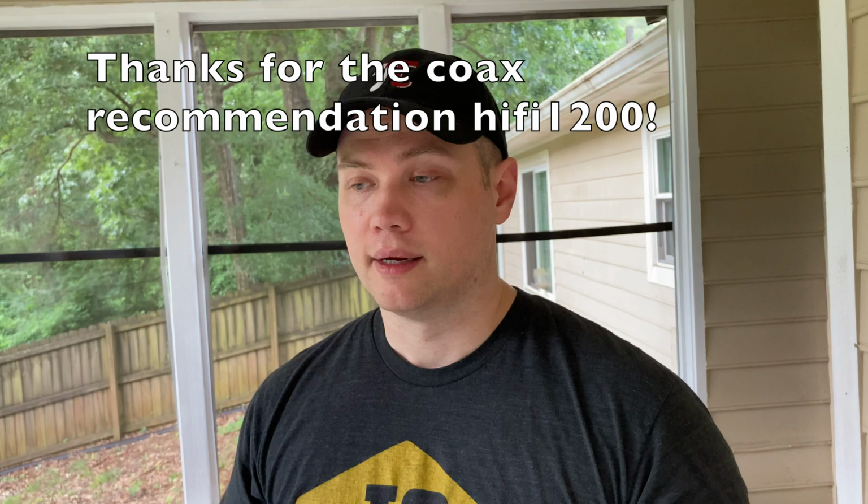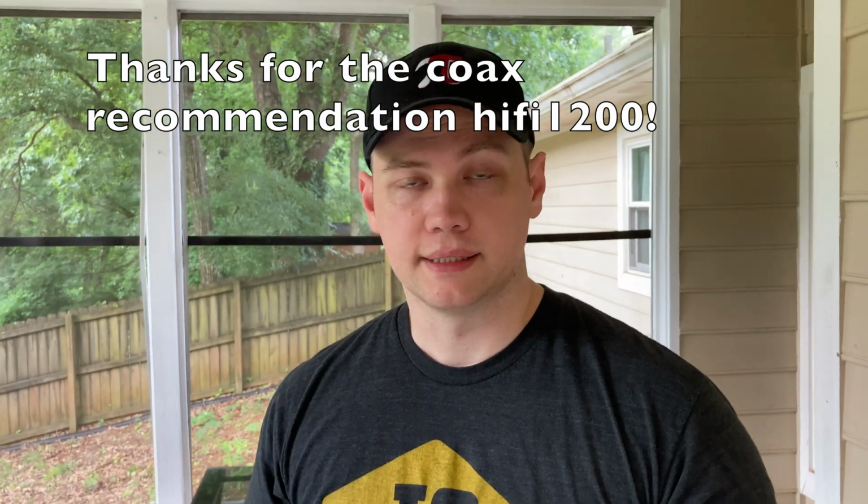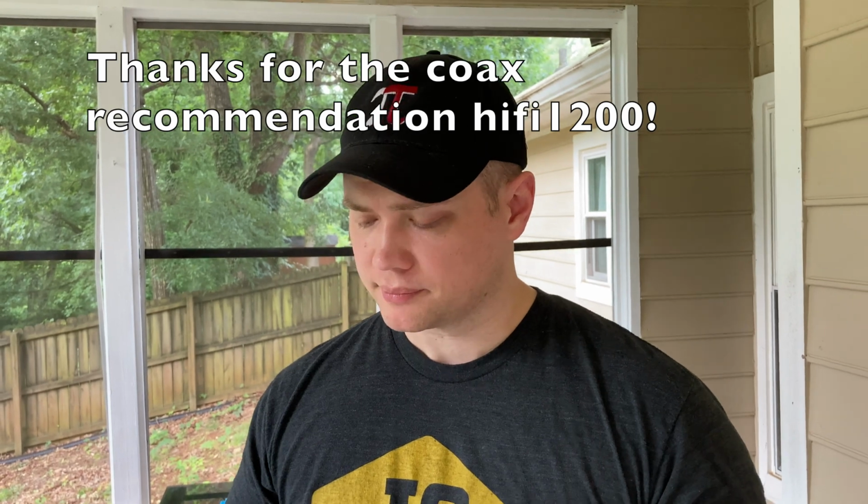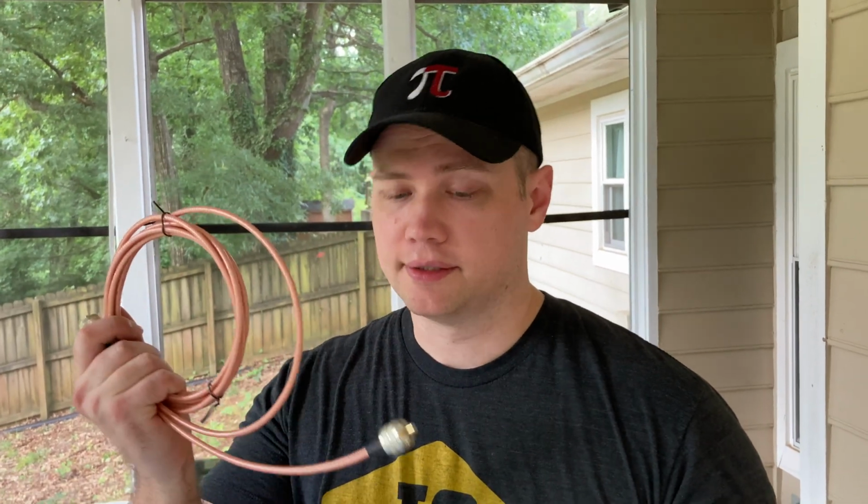So what I'm going to do, and this was at the recommendation of the eBay seller who made the transformer, so I'll post a link to that in the description, thank you to that seller, I'm going to take this RG142 coax cable and strip it down to just the insulator and the center conductor. I'm not going to use the braid, but I am going to leave this PL259 on the end, and I'm going to connect it to the SO239.